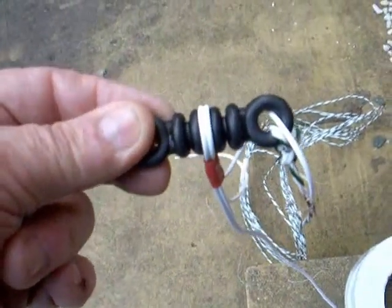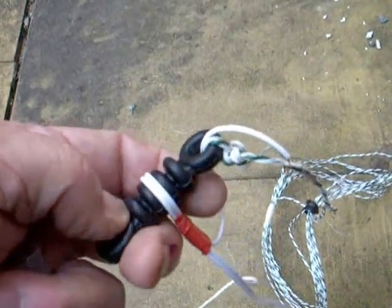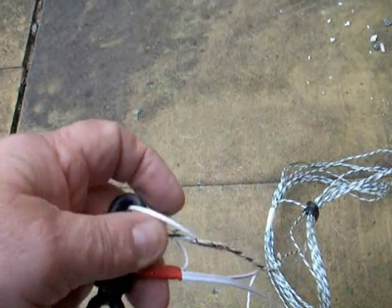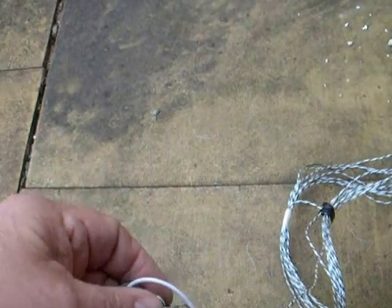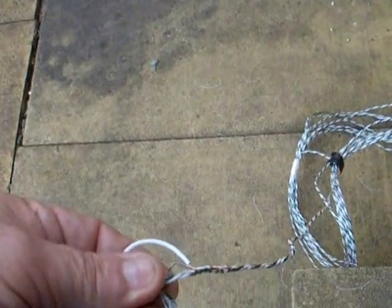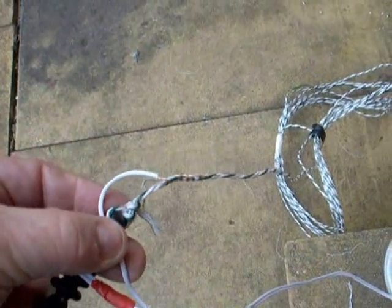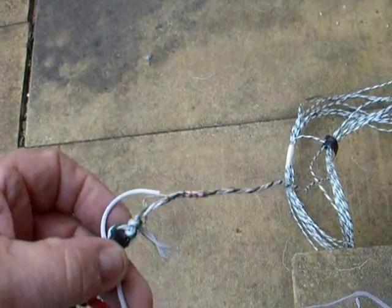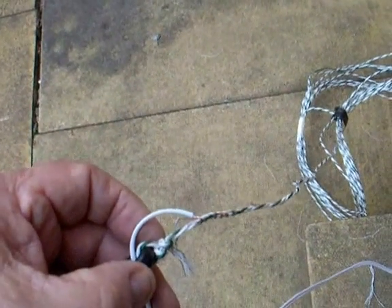The feeder is just simply looped around the dog bone, just taped, as you can see there, and a long slack tail goes to the wire tail of the arm of the aerial, where it's twisted together. And if it's actually tinned copper wire like this, you can solder it, twist it around the aerial arm as I've done there, and just simply tape it together for neatness.